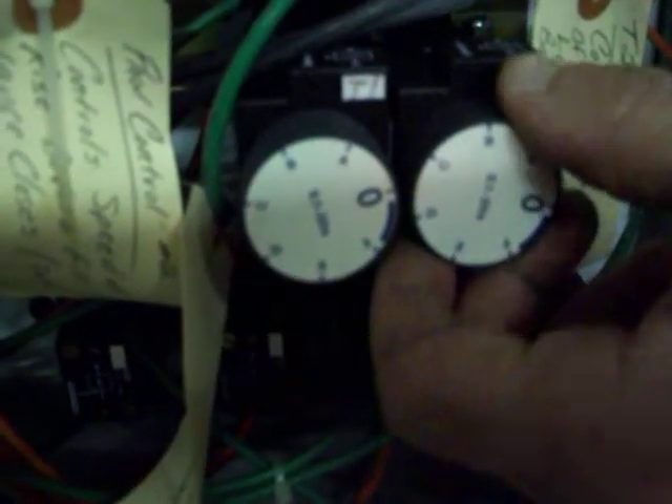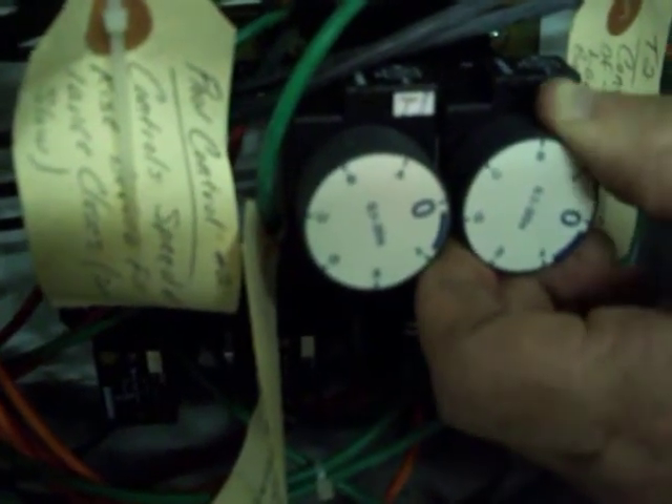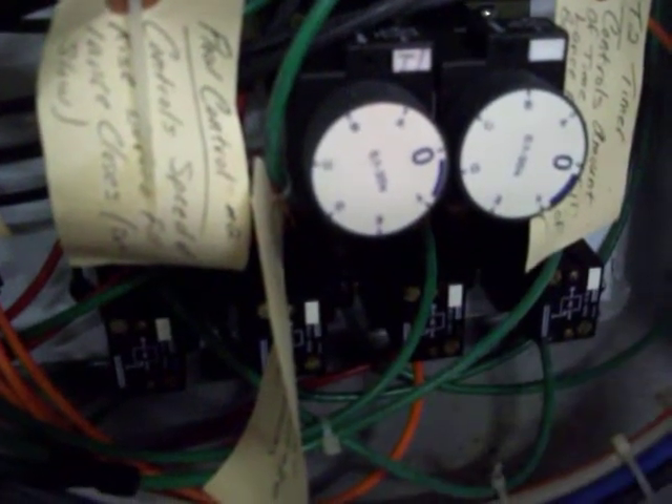Right now T2 is sitting at about B, so it's going to rise about a quarter to halfway up the pail. If you want it to rise further, go a little bit closer to C. These are orifice timers — you can dial them all the way around without hurting anything; they simply control an amount of time. Each division is approximately five seconds: A is about 5 seconds, B is 10, then 15, 20, and so on.